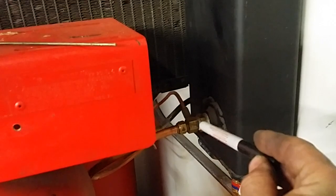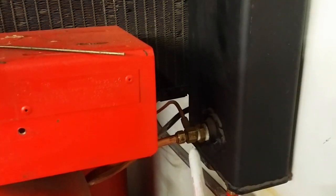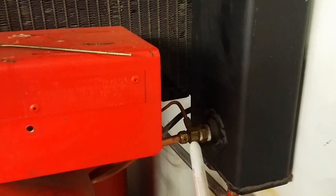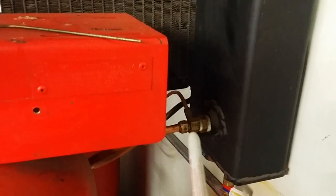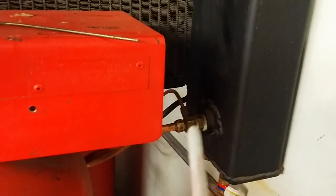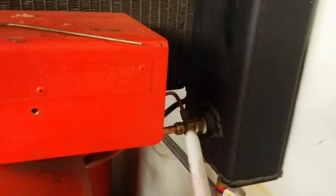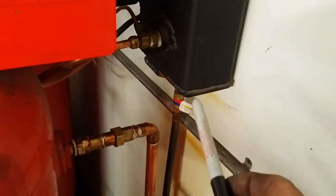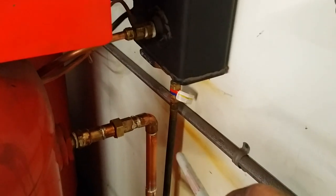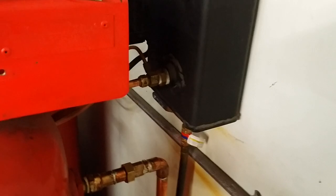The air exits out the back at about ambient air temperature by that time — this really scrubs the heat off. Then it enters the first coalescing filter. I moved my pressure valve that turns off the air compressor down here, because when your air compressor turns off, all the hot moist air in the cylinder head and that line drains down. Moving it here means everything in the cylinder head and line just drains into this filter.